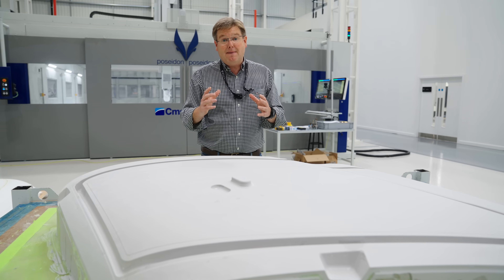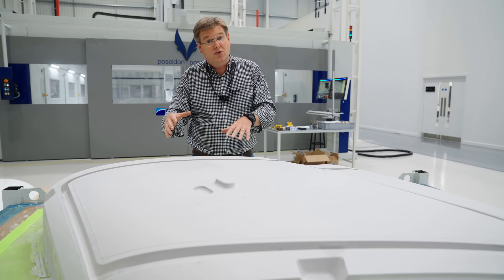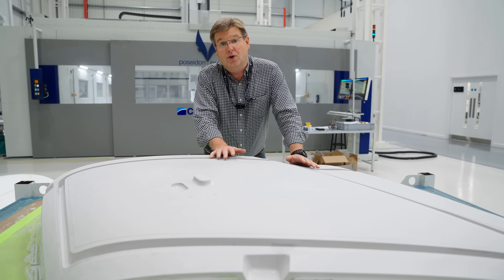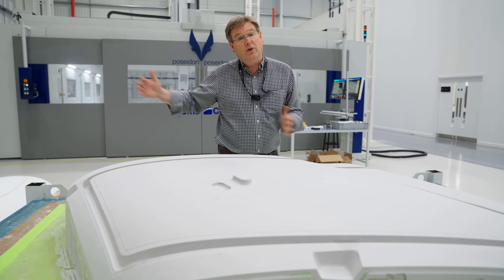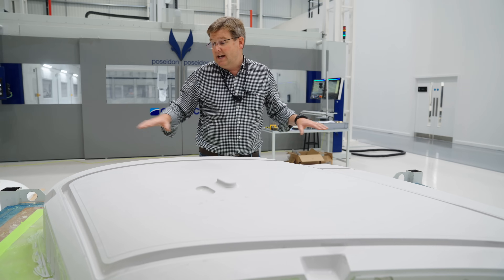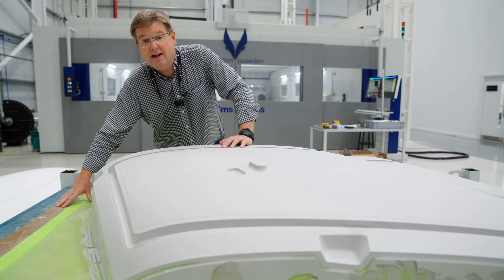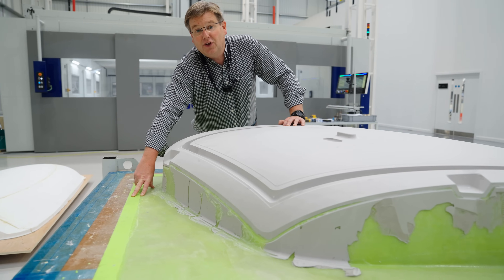The tool is now mounted on a rigid base that's readily stackable, because once these are used to produce the individual moulds they get stored for relatively long periods of time before they're needed again, so it's important that we can stack them out in storage areas. The tool now uses a vacuum type base seal on top of the baseboard so we hold vacuum integrity all the way through the core of the tool.